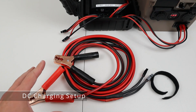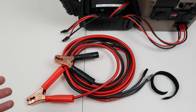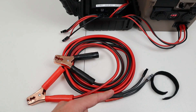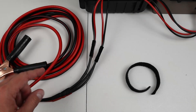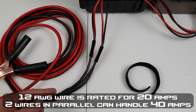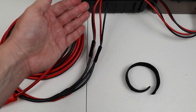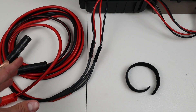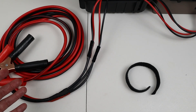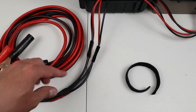This is how I plan to use the DC to DC charging aspect of the charger. Mine's a portable setup so it's going to be a little bit different but the principle's still the same. I have this 8 gauge 10 foot set of jumper cables — I chopped the ends off one side and this side connects to the battery. What I decided to do is splice into the 8 gauge wire here and split it into two 12 gauge wires, with two wires coming off the positive and two off the negative, tapping into Anderson PowerPole connectors that hook into the charger. Now 8 gauge wire supports 30 amps max. If you were going to buy a new set you may as well buy 6 gauge wire jumper cables so you could support the max 50 amps coming into this.